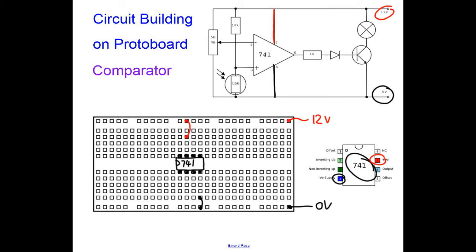Now I'm going to add in my potentiometer. A potentiometer has three pins — it's a rectangular object with a circle and arrow in the middle, so it has three connections. One end goes up to positive, the other end goes down to 0V — those are the two outside pins. The middle pin goes across with a different colour wire to pin 2 on the op-amp.